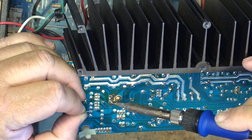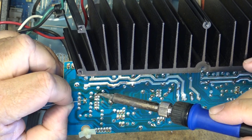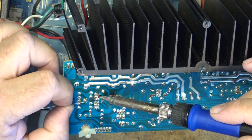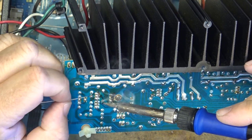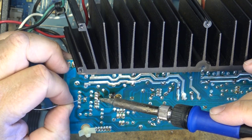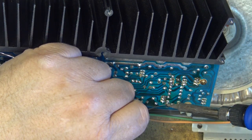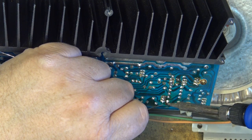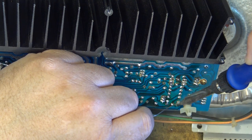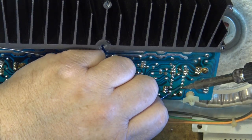Over the course of looking at this board very closely and resoldering a couple of connections that look bad, I've basically done most of the connections on the driver transistors and the preamp transistors. Now we're going to test this unit and see whether we've resolved the issue. Being an intermittent problem it's going to be tough, so I'll have to let this thing run for hours if not days to verify. I'm pretty confident we're in the right area — it's going to be a connection problem. Just the way it was acting up and the way it stopped as soon as I touched that cable is a better indication it was a connector problem, not getting a good connection between the input connector at the back and the board.